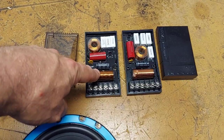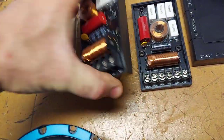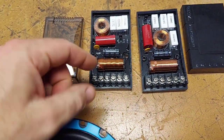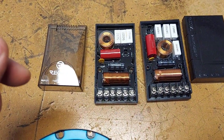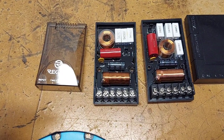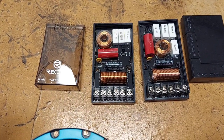In the low-pass they use a laminated core inductor, meaning a laminated steel core, which isn't bad. Air core is the best — what air core really has is the highest saturation point, meaning it can take more power. But it doesn't sound any better, so whether that makes a difference is debatable.